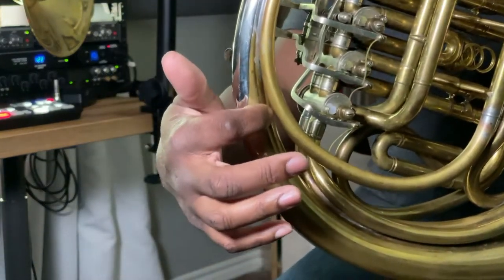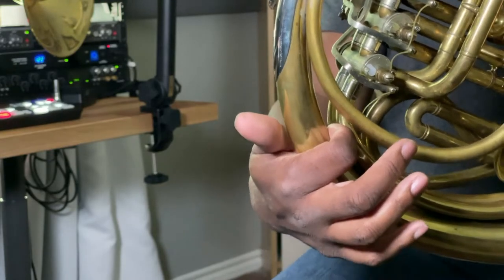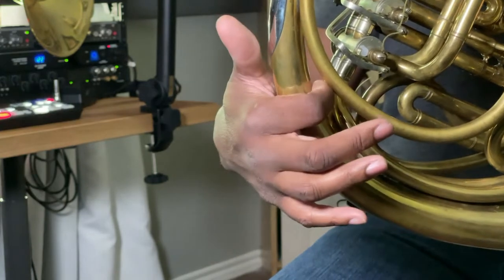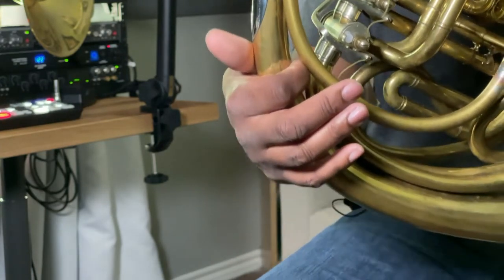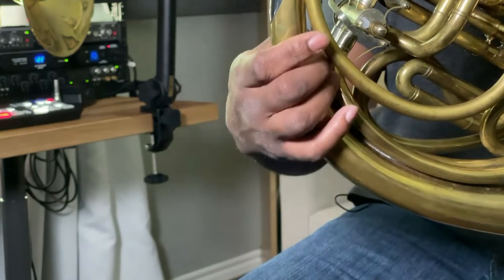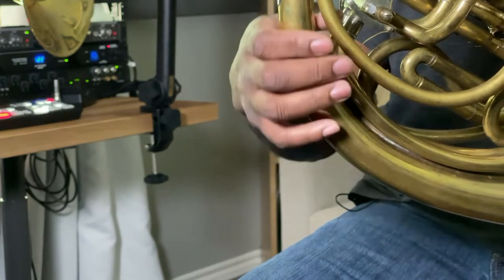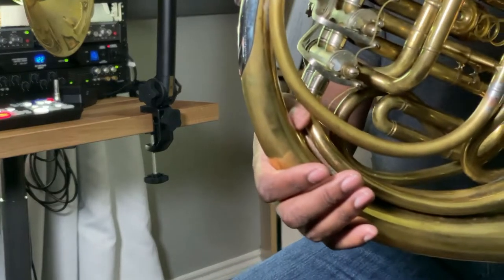there were cracks that were appearing in the bend here. Because the metal is seamed together, so it's a flat sheet of metal that's formed around a tube, and then it's hammered into place via a technique called brazing. It's brazed together. That brazing was starting to get old and starting to release. There were little pinholes here that needed to be repaired.